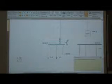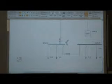And that's the only one we're going to calculate because we're just not going to spend time this morning. And I don't know, maybe it's 42,000, maybe it's 25,000. If it's 25,000 ampere rating and it's at 26,000, that's a hard call because it's energized from both ends when you close the breaker. Can you live with 26,000 on a 25,000 ampere bus? And it's a judgment call. Maybe you can and maybe you cannot.